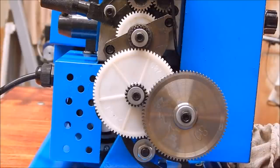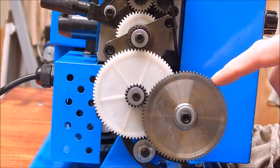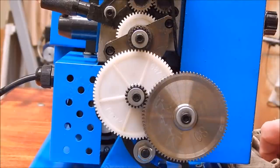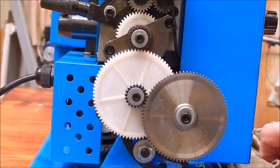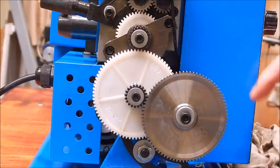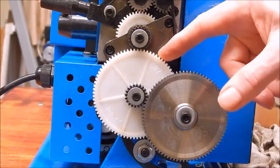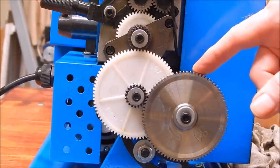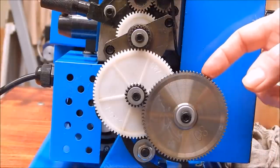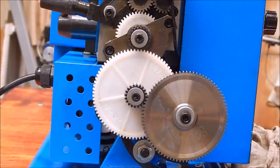Mission complete. Put the cover back on and we're ready to go now. But yeah, that's the thing with buying aftermarket stuff - you're never sure how it's going to fit. And it was just that tiny bit too undersized. Just took a skim off, a gnat's whisker, and it just went on beautiful and that was it. It might have belted on, but I wasn't going to do it. I'd like gears to go on and off fairly easily. As it is with the keyway in there now, because you have to knock that in, I'll have to take that off with a puller if one of these gears needs to come off again. You just use a three-point puller and that would take it off no problem. It's not on that tight, but it's tight enough that you won't be able to wiggle it off - the keyway just won't let that happen. But everything's good and true. Worked out well.